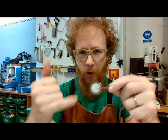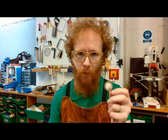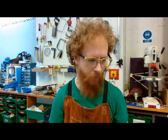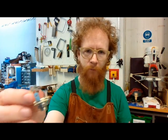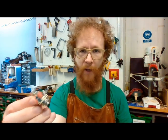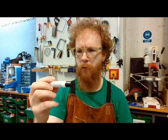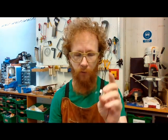These ceramic parts are very fragile. The most common way to break them is when the solder joint just gets ripped from the disc. They are a pain to solder back on, but it is possible. The best way to secure them is just to use a piece of tape over the wire to hold it in place so that you don't put any strain on the actual solder joint. If you were going to put this into an actual instrument, you would need a mono jack chassis — one wire to one terminal and one wire to the other, then solder it in place. If you're not comfortable soldering yet, you can cold solder using something like bare conductive electric paint, which is a high carbon ink that conducts electricity. You just put a dab of this on the wire and that holds it in place and keeps your solder joint pretty strong.